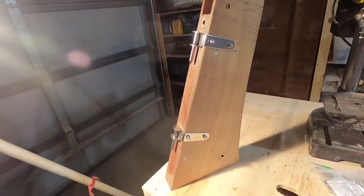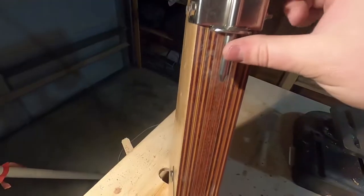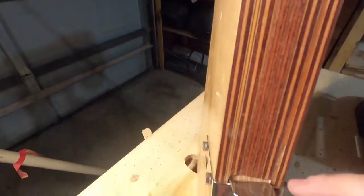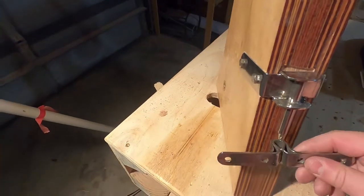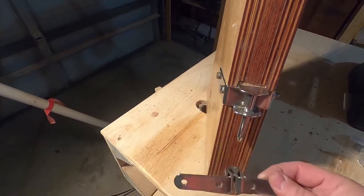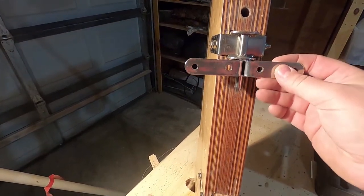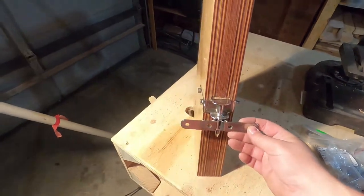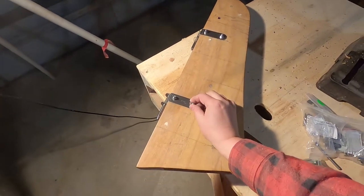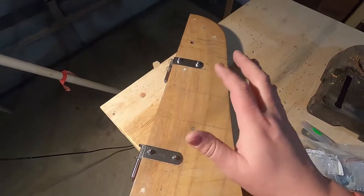Check out that majesty — both through-bolted, both dry fit, and they fit pretty good. There are a couple of issues up here from digging a bit too much out, but I'll chuck a bit of filler in that. The gudgeons here will go on the transom and these should be in line. There's a little bit of play so that'll be alright — I'll just make sure it's attached when I squeeze on. They are quite close together, but that was pretty much as far apart as I could get them, taking into account this cavity and this hole here. I'm hoping that's fine.